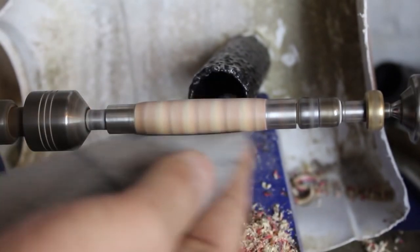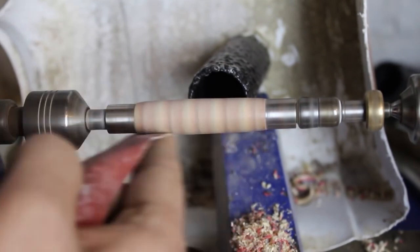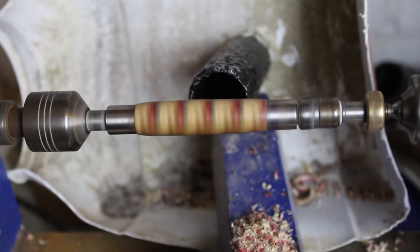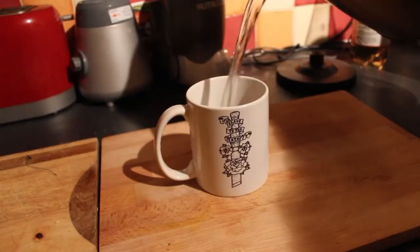After exploding my first blank I made another and turned it down to a good width for a sierra pen. To give the wood a smooth appearance I sanded it through progressively finer grits up to about 1200 grit and cleaned off the grain with a little surgical spirit when I was done.